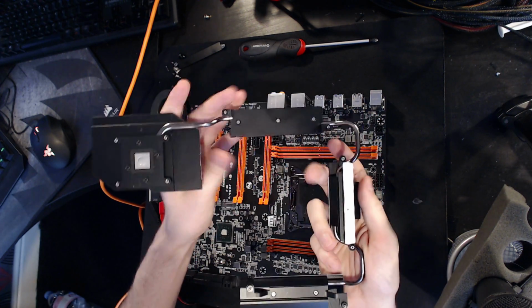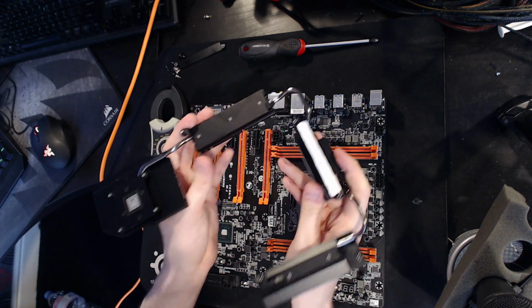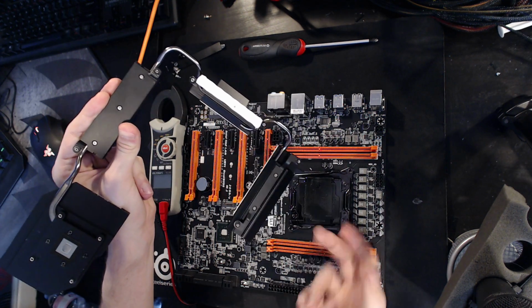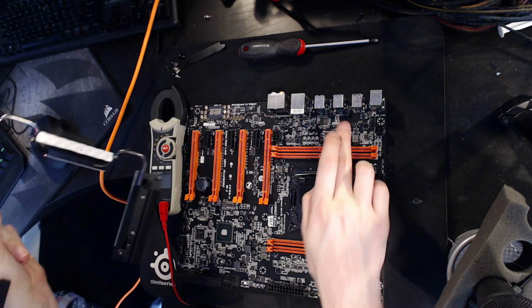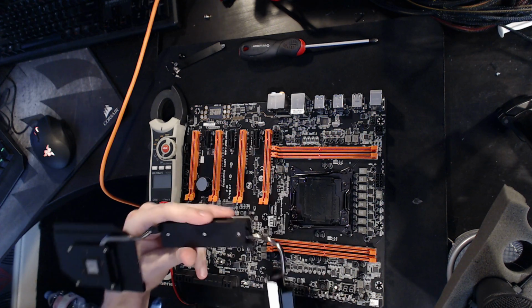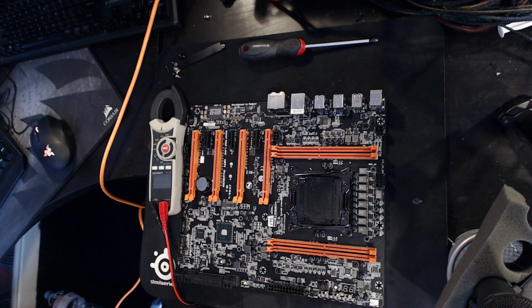So definitely Gigabyte did the right thing here with designing this, and dedicating it entirely to the VRM, because it does not sink heat into the memory power area. There are no thermal pads on here, and you do have memory power in these areas of the motherboard. So, good decision with the heatsink on Gigabyte's part here.